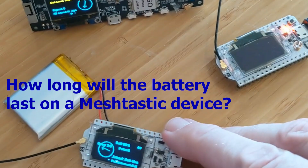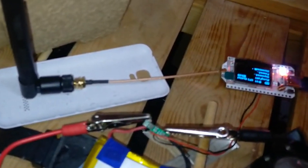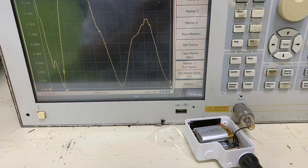How long will the battery last on a Meshtastic device? Meshtastic devices are designed to be low-power and consume very little power. Within Meshtastic devices, NRF-based devices use a fraction of the power needed by ESP32 devices. A test conducted by Paul showed a Heltec ESP32 LoRa V3 worked for 24 hours on a 4000 mAh battery. In another test conducted by the Coms Channel, a 2600 mAh battery worked for 1.5 weeks in an NRF-52 based Meshtastic device. Links to these videos are in the description.